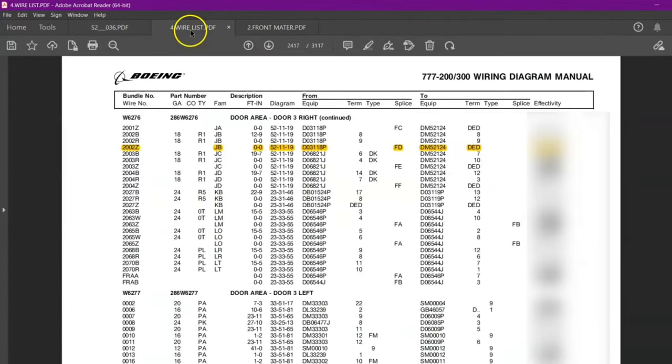Now for finding any procedure, what we normally do, we go in front matter, we'll type part number, we'll search for our part number. Sierra 280 Whiskey 555-16. So in the content, it will search for us and it will give us the chapter which we have to refer. So 16, you can see your grounding module, the chapter is 20-90-15. So let me write down over here SWPM 20-90-15. Okay, for everything. So let us quickly open that. 20-90-15. This is the subchapter, the assembly of this module.